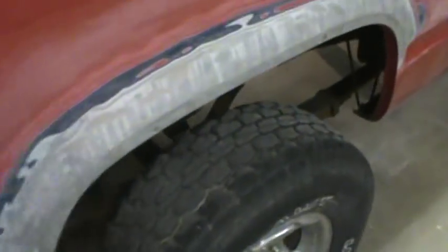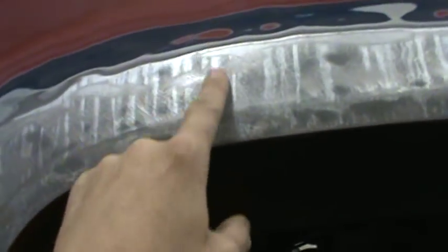The other side over here - these spots here. Now this has been outside after I've done this work and it's rained on a couple times. You can see I did not take the etch off of it - if I had, it would have rusted completely through. So what you see, these streaks, are just from me sanding it. This is sanded in 80 grit and I faded it out with 180. I was going to etch prime it so I'll sand it again.